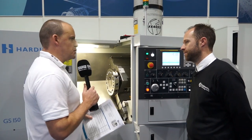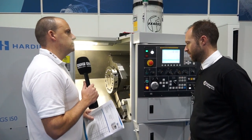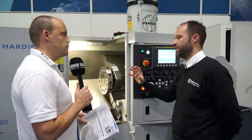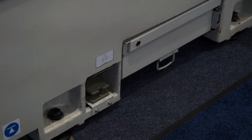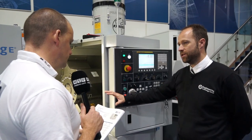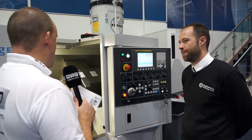With a machine of this size, is it important how it's built? It certainly is. Hardinge is renowned for their Super Precision lathes. This machine has taken the philosophy of a Super Precision but tailored it back to give a general precision lathe. I did see here that it's a one-piece bed - yes, a single casting, 30-degree bed. There's no complications of interference between components.